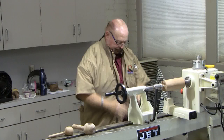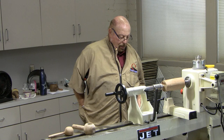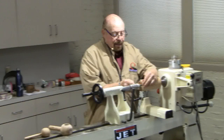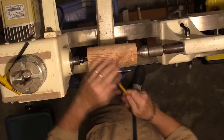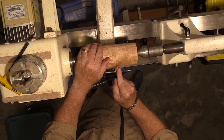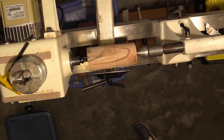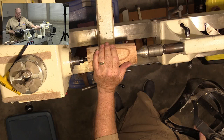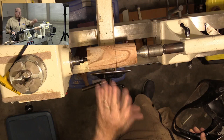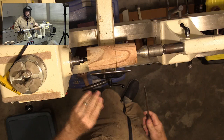This is about three inches in diameter and I'm going to draw down three inches from the end because I'm going to turn a sphere. On safety — I usually wear my dust mask but you wouldn't be able to hear me. Do use a face mask. When I've turned these from some logs, I've been hit in my face mask multiple times by bark or chips of wood. There was a weakness and it flew off and really smacked and scared me, but luckily I had it on — no harm, no foul.